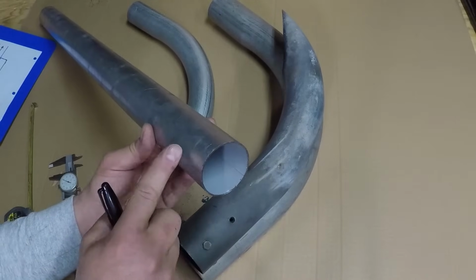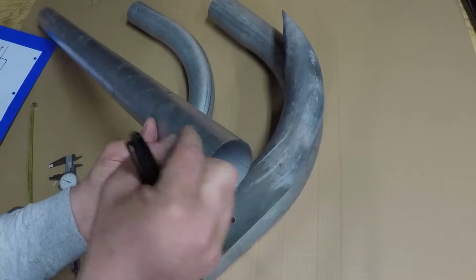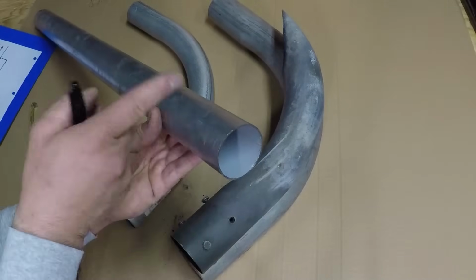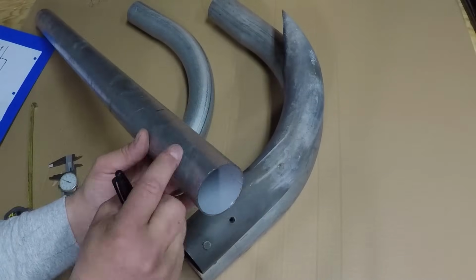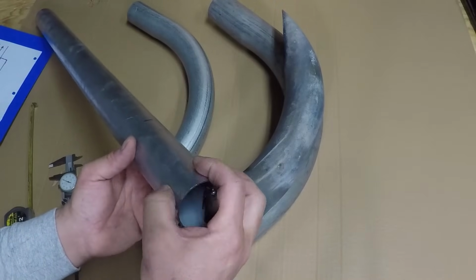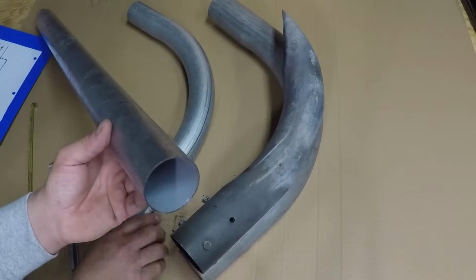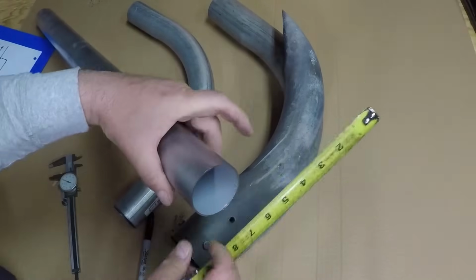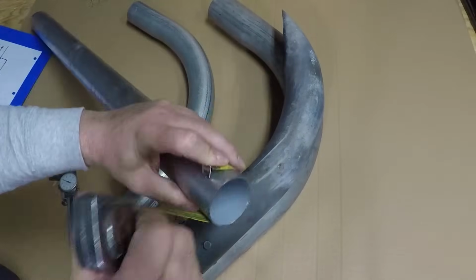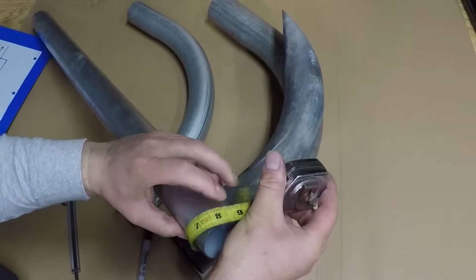I'm going to divide that into 8 sections, because you look for an even number and you try to make those cuts as small as possible to get more of them, so the gas will do its circulation. So each section is going to be about 0.859 or 0.86 in length, which is about 55/64. If you don't want to do math or you have problems with math, just take a tape measure and wrap it around like this, and then divide this measurement into an even number.